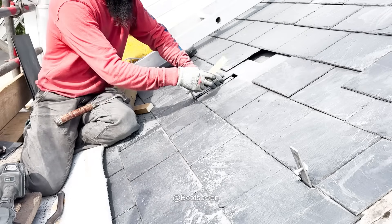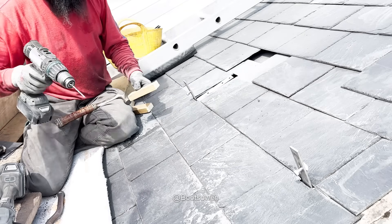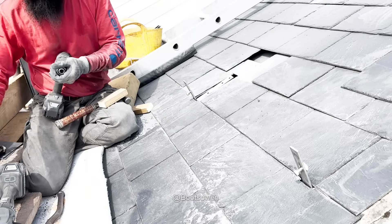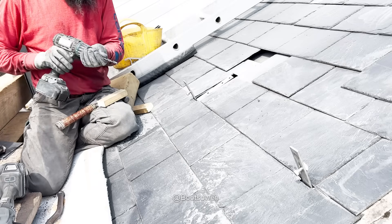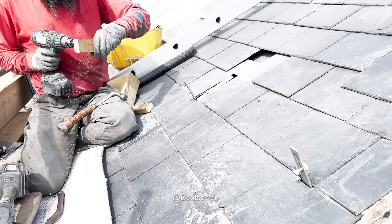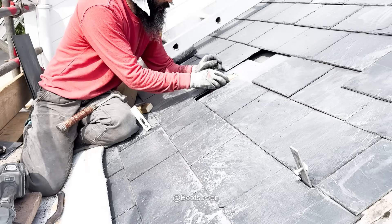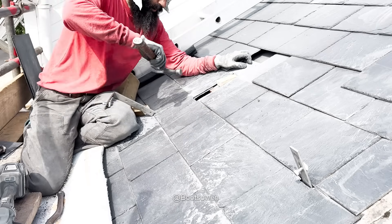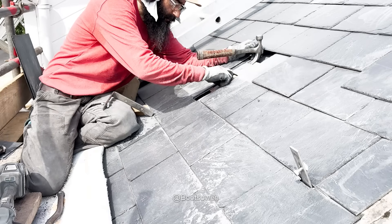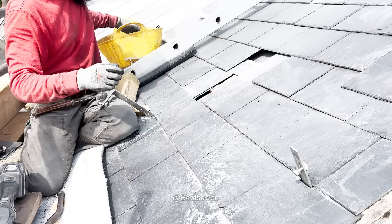Here I'm trying to size out where I need to drill a hole. These are little blocks of pressure-treated roofing battens — I need to drill a hole otherwise I'll split it. A lot of the kits come with plywood but I'd rather use wood that's treated, since the battens in the roof are treated. I just cut them to about ten centimetres (four inches) long, and then a shorter one about half as long as a pad underneath. This is just to bridge between the rafter below and the bracket I'm going to screw through.